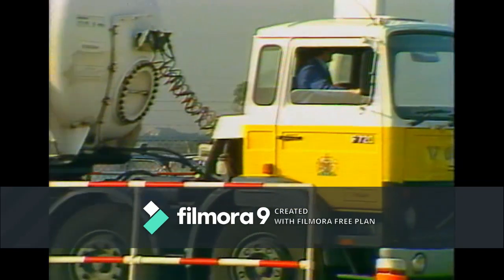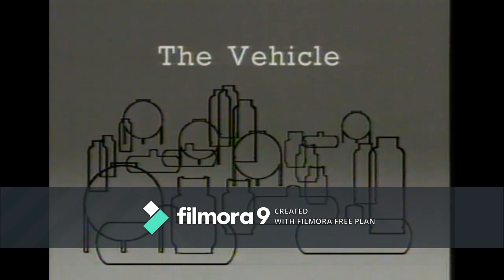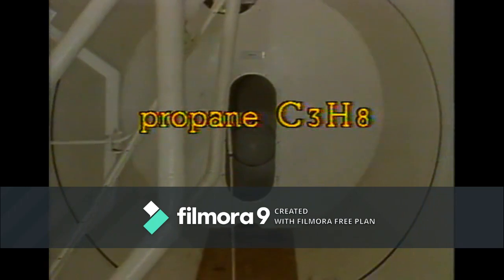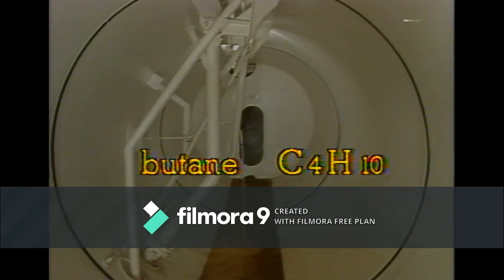So, let's look first at the vehicle itself, with its various fittings and accessories. The largest component is the tank, which is made of steel and which can be seen here from the inside. Preferably, tanks and equipment should be designed to meet the specification for handling propane, so that they can also deal with butane, for which the demands are less severe. If your company operates butane-only vehicles, however, only butane should be loaded.